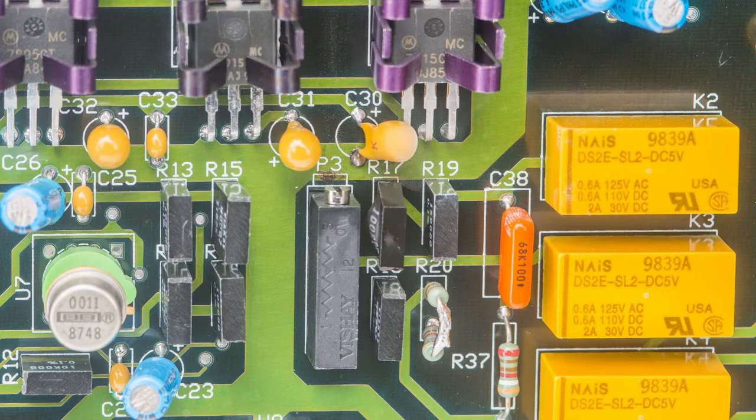And there are a bunch of other resistors, they are different values. So this R19, I believe that is R19 down there, R20, R18. Those looked okay, so we will actually be checking them. And this P3, the big black potentiometer with Vishay label on it, it's actually very expensive. It's a $45 potentiometer. It's also a metal foil trimpot with 10 ohms nominal resistance. So yeah, we'll have to check that one, because essentially all these resistors, as we will see in a second, they are all connected together.